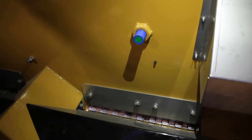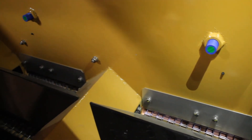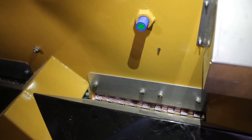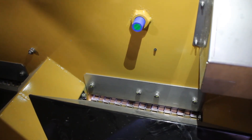Another part of your weekly checks is to inspect the gate opening. You want to make sure that there's no product buildup anywhere underneath the gate, and the gate measures equally left, right, and center of the gate, as well as matching right and left sides.